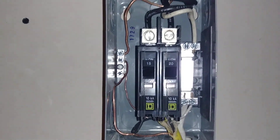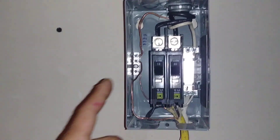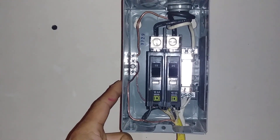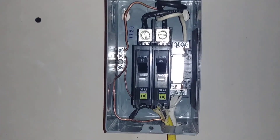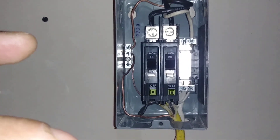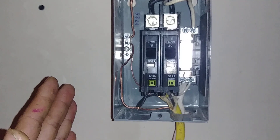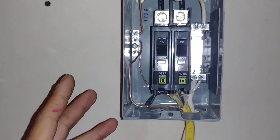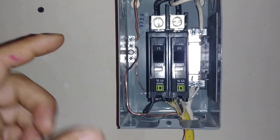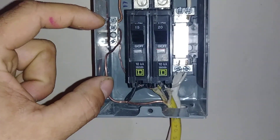So if anyone was wondering how to do it, this is how you do it. A lot of times you'll purchase one of these panels and they won't come with a ground bar, and you'll wonder why — do I just put it on the neutral bar? No. Just look on the sub panel, look somewhere on the box, and it will say something such as 'ground bar must be purchased separately.' So make sure you look on there, and before you leave — Home Depot, Lowe's, your hardware store — make sure you get that separate ground bar kit if needed.